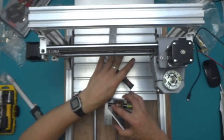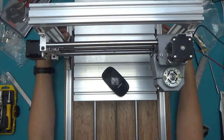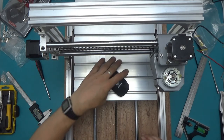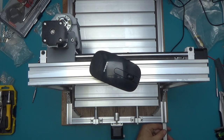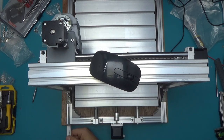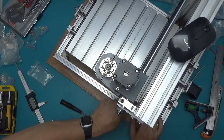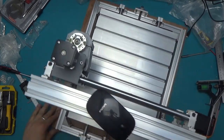The camera's losing focus with all the shiny stuff. Now to square this up I'll turn it around — I've got a smaller distance on the back, the side we've already tightened, at 66.3mm. I'll do the same measurement on the other side. There's a little bit of tension — I'll fully tighten this, and we are really near the end.